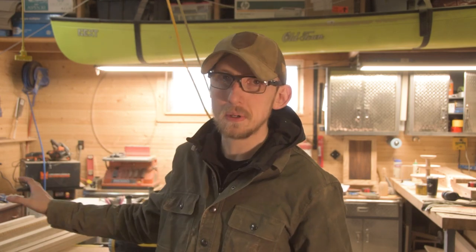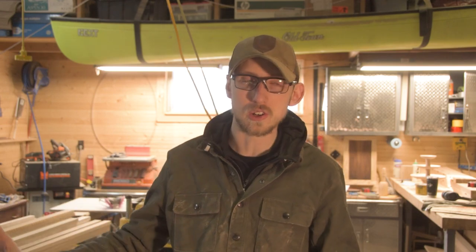They started appearing. I've got one of my longer pieces where I ended up jointing it too much and the ends are just a little bit too thin — they're almost five-eighths of an inch thick, so we're not going to be able to get our final piece out of there. We're going to have to remill some more boards. This is where it's really important to have a little bit of extra wood in your shop. On my long stretchers, I should have used some five-quarter stock — that's the only five-quarter white oak I've ever seen in Calgary, so I didn't want to use it up. But for stuff like those long stretchers over four feet long, that's a perfect time to use that kind of stock.